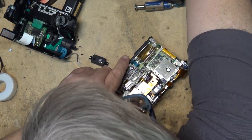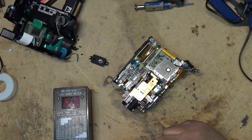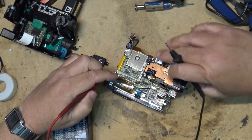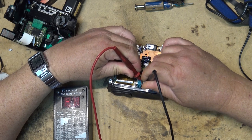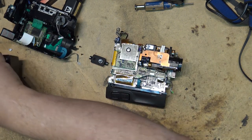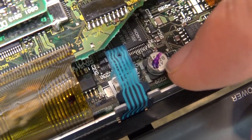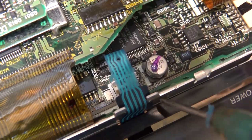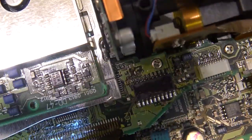Let's just measure the ESR on that one. You can see the crap that's leaking out of it already — it's open. See that? That cap is open. I'll get the camera in close so you guys can see it. The electrolyte is leaking out of it. If you look down here, you can see the solder around it is all discolored from the crap that's been leaking out. That's the problem with them — they leak.